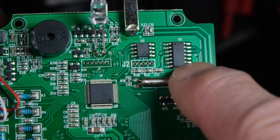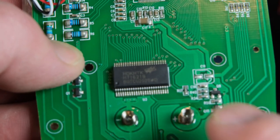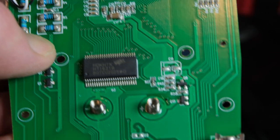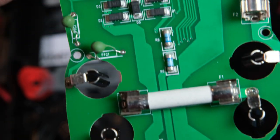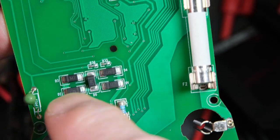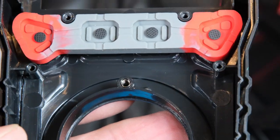This chip up here looks like it's been whitewashed, so we can't see what it is. Same with this chip. We can see that small support chip over there. This chip we can see is supposedly a display chip. There's our diode setup. There are our small PTCs - they're not very big. We don't see any MOVs or TVS diodes. We see the diodes for the current sense but not for the voltage side.